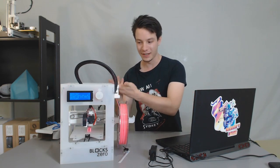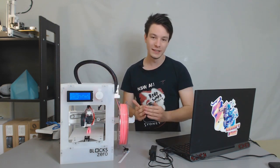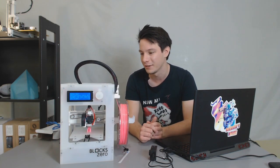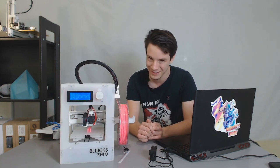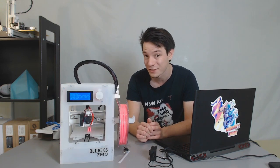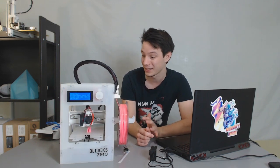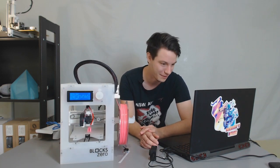But basically you want to give the acrylic a bit of room to spread that stress. Because there's none here, it's a sharp internal corner. That's a stress point, that's where they form, and that's where you're going to get a crack. So when you assemble this machine, do not over tighten those nuts and screws, because that will crack the panel. Even though it looks thick and strong, acrylic will crack pretty easily. It's beautiful to laser cut. It's really easy. It's cheap, but not the toughest material.